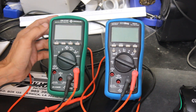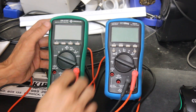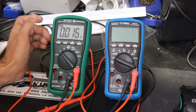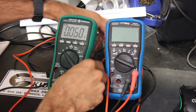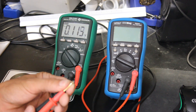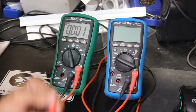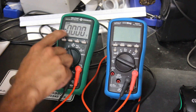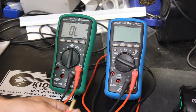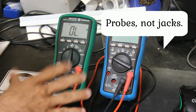He answered back and said there's no issues. I got it in a few days ago and I'm not sure if his definition of 'no issues' means it turns on, but this meter definitely has an issue. You can see it's pretty much ignoring the input jacks. On DC it kind of floats and you can see the minus sign flashing. Continuity is the real dead giveaway — we get nothing, and I've already swapped jacks from the Brymen to rule out a jack problem.